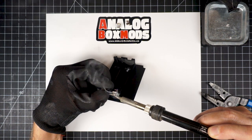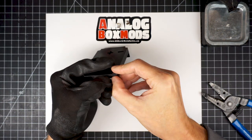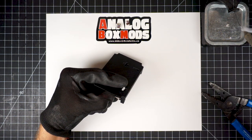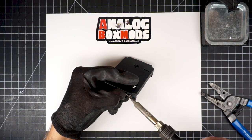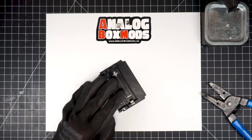So I don't necessarily suggest doing what I'm doing here. And if you do, you've got to be really fast about it. And the only reason you can go fast here is the contact is tinned. The wire is tinned. I've got a molten blob of liquid solder on the iron. So just touching the two melts everything together in a second or two.